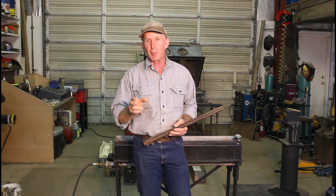I've been watching Mark Novak's channel — he's got a great channel, used to call it Anvil, where he does a lot of rust conversion stuff, primarily with military surplus rifles, old rusty ones. He's got this coating of red iron oxide rust, and he's boiling them, carding them, and turning that red rust into a black iron oxide layer, which is all that bluing is.